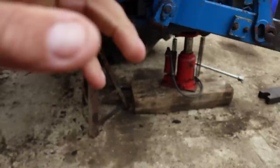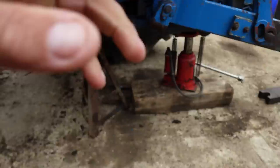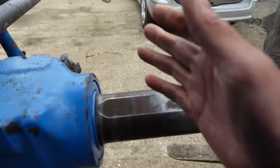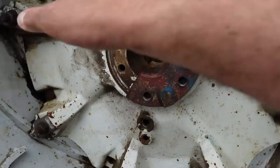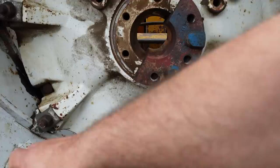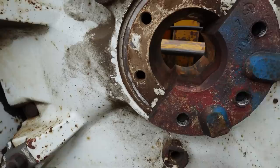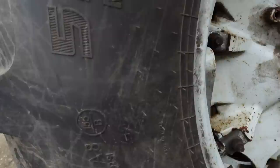You've got two flats on the axle, and then underneath there's another flat. They're not top and bottom - they're on like a two-thirds position, sort of eleven o'clock and seven o'clock. But that's all that does, and that does allow you to slide the wheel on and off so you can adjust what track width you run. You can do that on the rakes there as well - undo them bolts and it'll slide in and out. So you've got a lot of possibilities for track width.